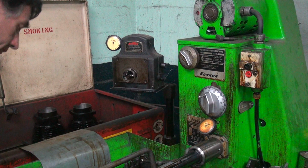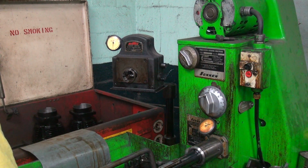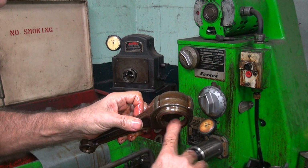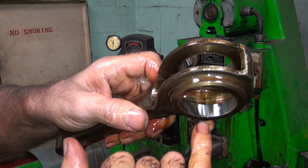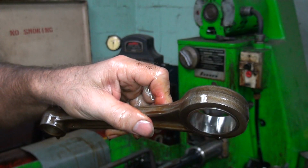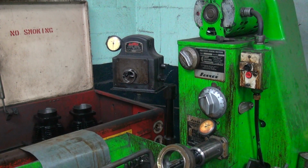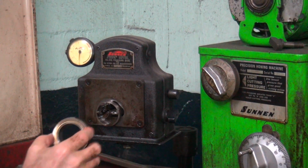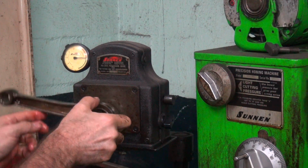Right now between 0 and 1/10 up. Remember? Should be a little bit smoother on our finish also. Yep, a little more even. So you can see how smooth the finish is in there, like the big one. See how it's pretty smooth and even? That's what you're looking for. So you look over here on the dial. It's hard to do. The camera's getting a little oily from me using my fingers on here. Okay, so you can see the dial right there. It was about 0 to a half, now it's at 1. See, it's pretty consistent.